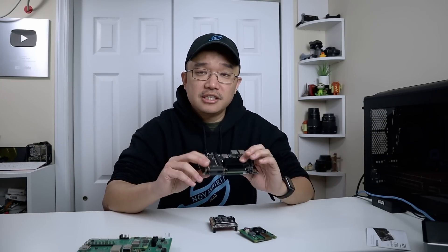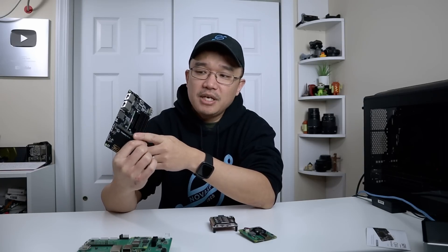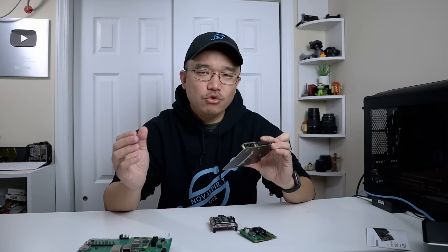I'm not using this in my production environment — I have the Seed Studio version running there — but I can tell you this CM4 board as an OpenWRT router is very impressive. I was able to push up to 11,000 connections through this without any trouble at all. The CPU probably raised to 1.5–2.0 with 11,000 connections, which is extremely impressive. I'm using a 4GB board, which definitely helps, but the ability to install Docker — like what we've been doing with Pi Hosted — makes this router worth a lot more than its price.